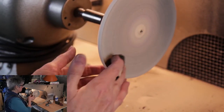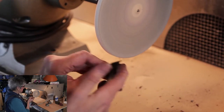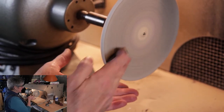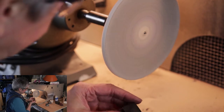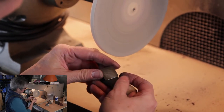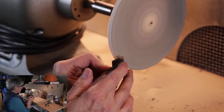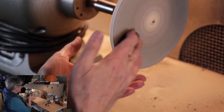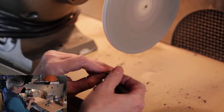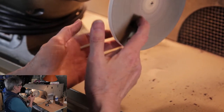Carefully slide it on. That's coming — I shouldn't have to spend as long doing this because the biggest step is from the sanding to the grey star. The way to control the heat is just don't leave it on as long. Even though the leather can take it, just don't leave it on the lap as long — do it more like this, and then it's not going to get as hot and will cool off more quickly. I notice there's a little something in this corner right here, so I'm going to put my finger right in that corner to apply a little extra pressure there.